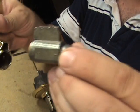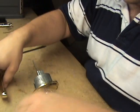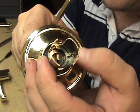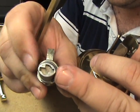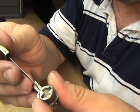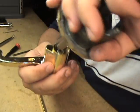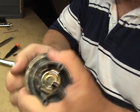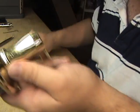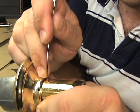The cylinder just slides right out the back. That shape is what keeps the retainer — you can see the retainer pushing in. When this cylinder is locked up, that tip right there is what's keeping the retainer from pushing in — it hits that. When you turn it, you've got more room over here and that allows the push in. Put it back in, pop it back on, then turn it back to lock it up and it's back on. The retainer will not push down because it's in the locked position.